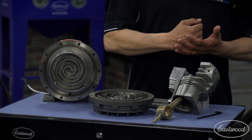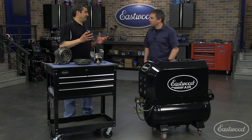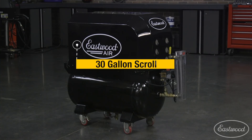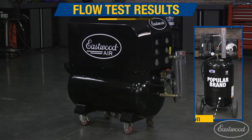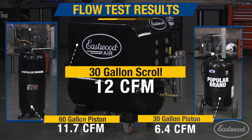So what you're going to see is a true CFM on these compressors. We recently did some testing — what we saw was that the advertised CFM on the tank was two to three CFM higher than what the standardized outlet measurement was. That's what we're measuring here — that's true output. That's what you want to look for when you're shopping compressors: find out from the manufacturer where they're making the measurement. You want to compare apples to apples. And through the test, you can see the scroll compressor killed the 30-gallon and outperformed the 60-gallon piston compressor, in a new innovative compact package. And that's just technology.